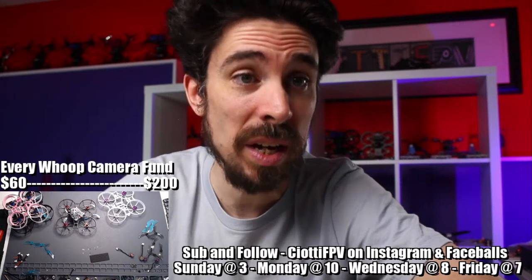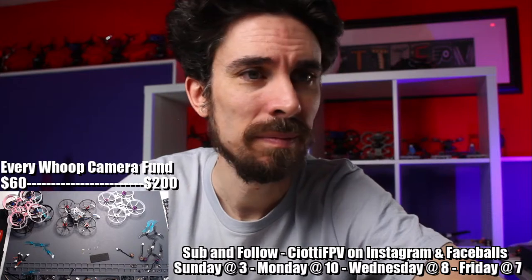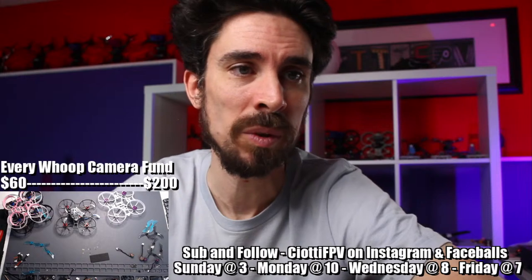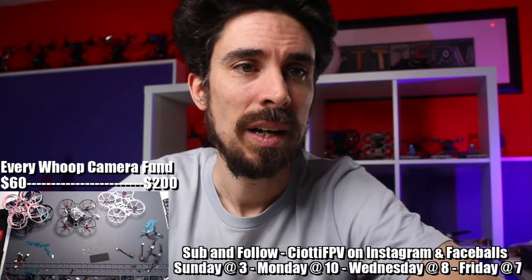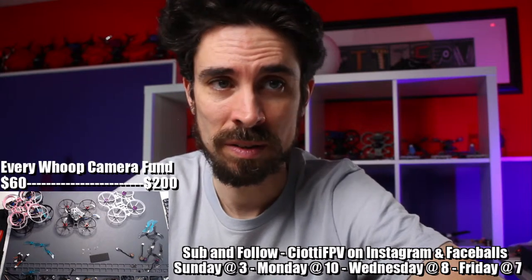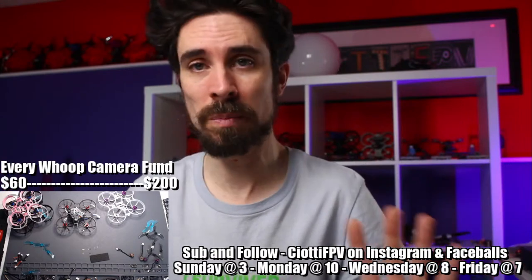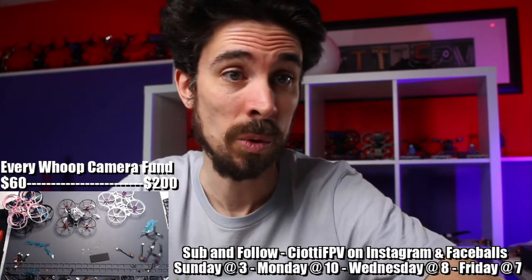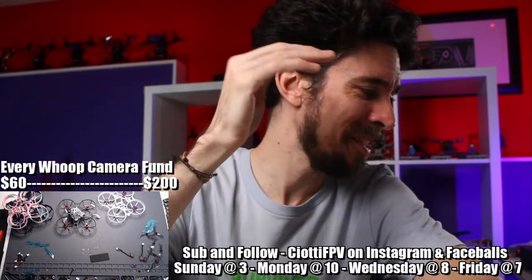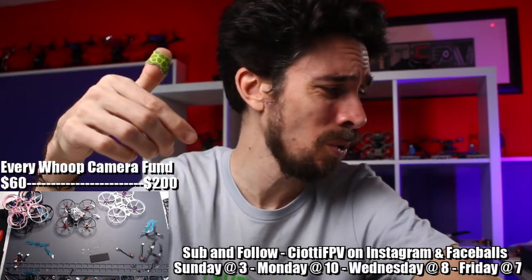Limits 20 says I broke three 1S HDZero VTXs. They're still working, though. What? But range went from a 10 to a 2 on the scale from 1 to 10. Just broke another one today. I've been very concerned with the durability of all of these digital systems when it comes to Tiny Whoops, because we're getting them really hot. They're sitting up on top with grommets and a little M1.2 screw going through them.